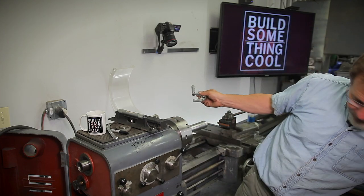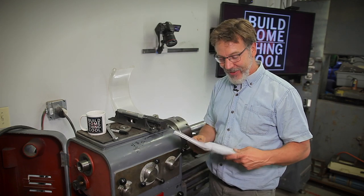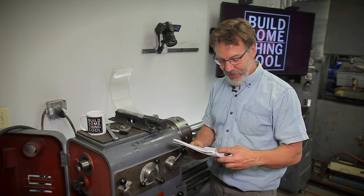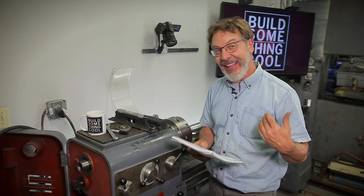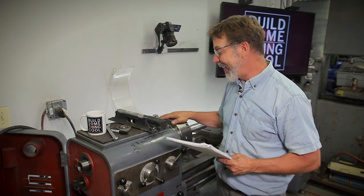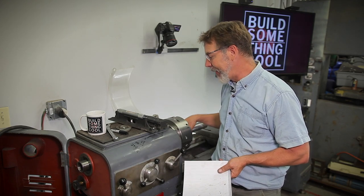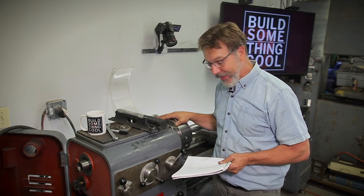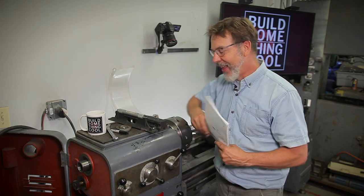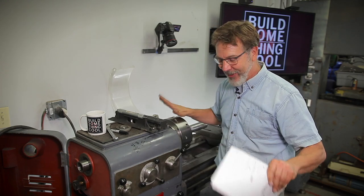I have to say I got really lucky on this. I got this all lined up in one, two, three, four, five steps — pretty good in about 20 minutes. I think that's a new record for me. I didn't think I could get it into alignment. I've read it a couple times and I'm coming out with about a half a tenth. So it's pretty amazing — I've got this lined up. The bad news is I'm not going to do the leg leveling of this because I got this perfect and I don't want to mess with it. Once you've got it, you don't mess with it.